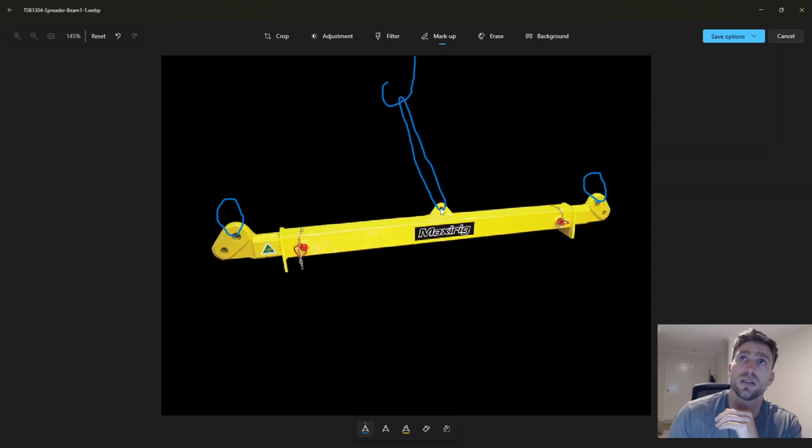Now the second way, say that the slew crane has already got chains on the hook. How can we pick it up with the chains? If there weren't shackles on here, I wouldn't go get shackles and put them in the hole, because that's just wasting time. What you can do is grab the chain, make a little stinger like this and a shackle, and go off the middle.